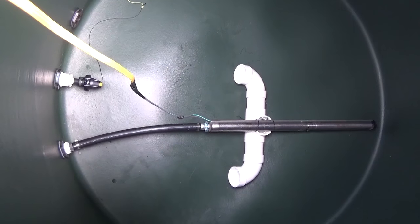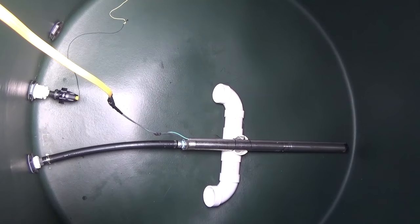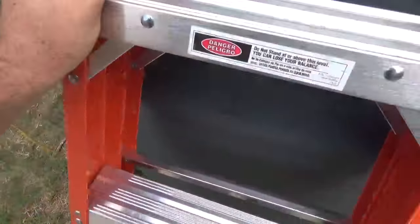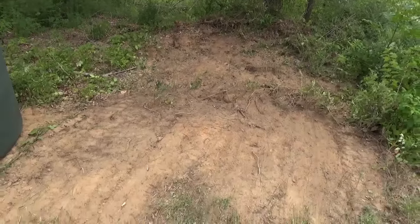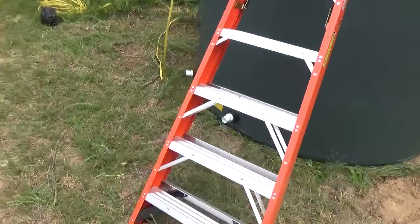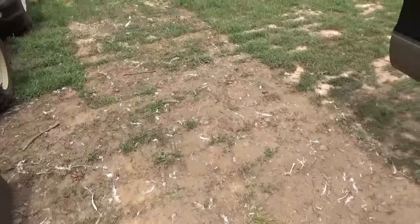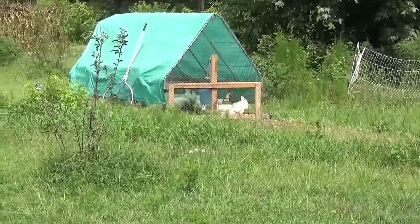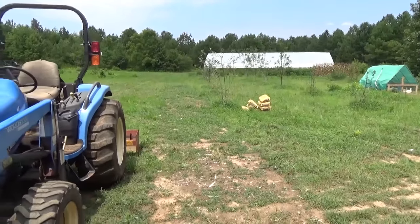Three bulkhead fittings, a pump inside here — it's got its own low water protection, its own solar to run it. Then we've got a well that's a quarter of a mile away that we'll put the same pump in to fill this tank. We're going to bury it over here — not quite bury it, just put it in the ground about two inches with six inches of pea gravel and textile fabric underneath. Then we're going to take the water to the high tunnels. They've been carrying water to this location for way too long.